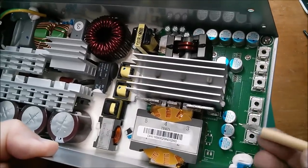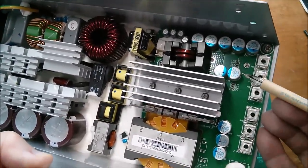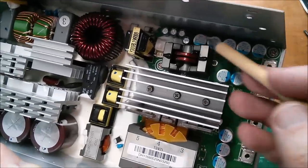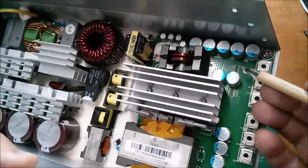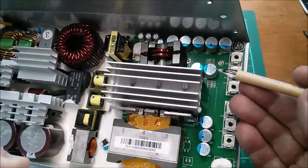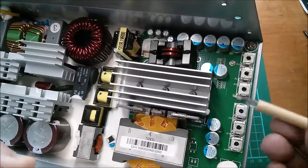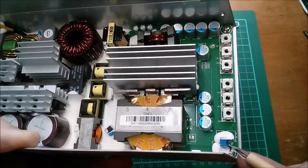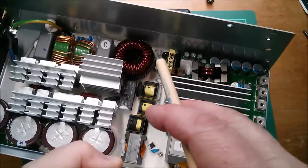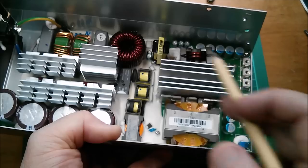The output has low voltage capacitors — all 1000 microfarad 16 volt — and there are a lot of them. There are also many multilayer ceramics. Since this is a single output supply, this must be largely a big parallel array of capacitors. By paralleling up lots of capacitors you get the equivalent series resistance down rather than using one big fat capacitor. A lot of this board is heavily gunked in silicon sealant running up onto the side walls of the metal box, so there's no way to get the PCB out to see how many semiconductors are on the underside.